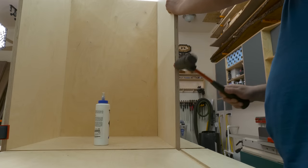Attaching the drawer slides is pretty simple. All you really need to do is use a scrap piece of wood to act as a reference for the front of the drawer slides, then open the slides on a flat surface like the bench or your table saw, and butt the front of the drawer slide up against that reference piece. Since everything should remain flat, all you have to do is screw in a couple screws and remove the slide mount. These drawer slides are soft-close, full-extension, and pretty cheap at only $9 a pair — I'll leave a link in the description. To attach the slides to the case, I cut out a few scrap pieces to act as spacers and set the front of the drawer slide to the edge of my edge banding. For the bottom shelf, I used a couple of shims to lift it off the bottom slightly so I don't get any rubbing. Then I tested the fit of all my drawer boxes, making any adjustments if necessary.